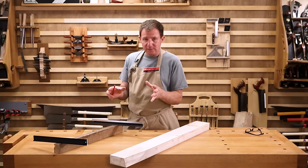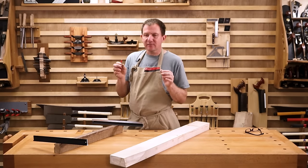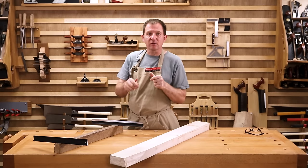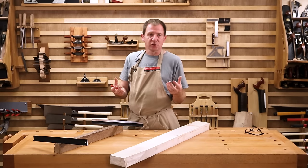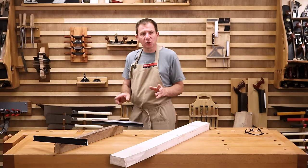If you go with just wooden ones, you've got to plane them up exactly the same size, put them either end, but if they're two bits of wood the same colour, tricky to actually identify where things are out. So ideally, two different species would work better. On the aluminium ones, they're nice and light, they pack away, they're there, okay? So our winding sticks, all we've done is position them on the piece of wood.